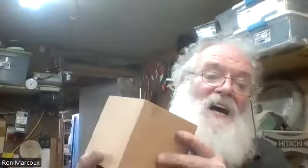I have a Nova 2 chuck with, I think, 35 millimeter jaws, and I've been using those a lot. In my process of doing this, I probably do a lot more steps than most people would, just because I work at it and I nibble away at stuff. So this is a piece of cherry. It's good and dry. Even if it weren't, I wouldn't be too worried about the movement that's gonna happen, because you're not dealing with a normal looking thing. This is bandsaw cut on the outside. But it is a cube, and I'm not worried about the finish on the side, because I'll take care of that at the very end.